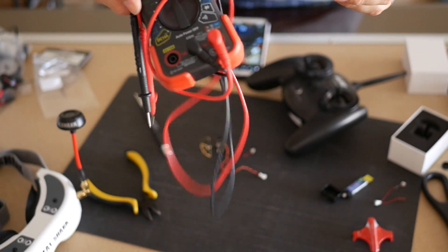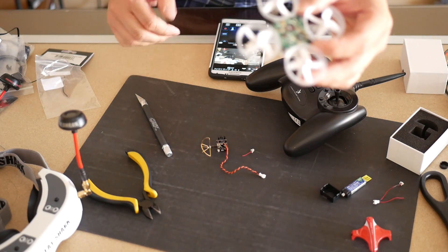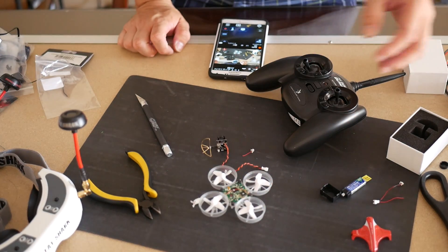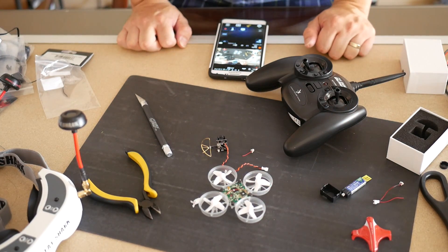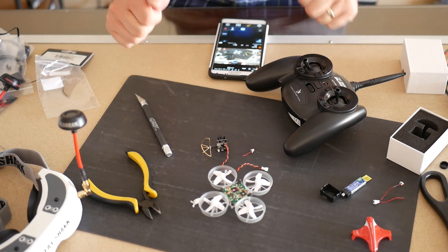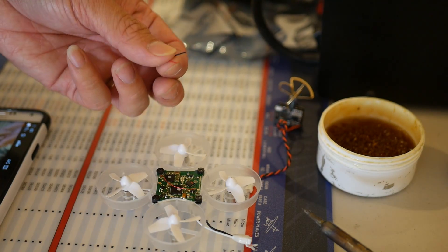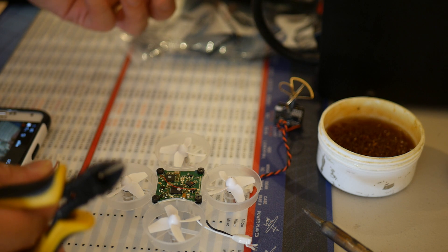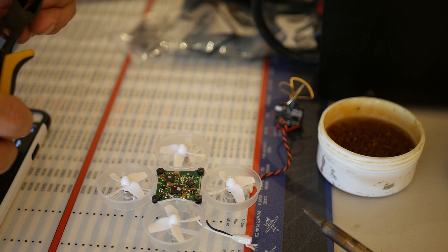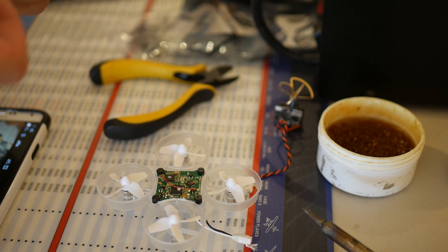It's good to have a cheap battery meter — get a 10 to 20 dollar voltmeter from Radio Shack or Home Depot so you can properly check the polarity before soldering. Now let's go to the soldering bench. First strip your little connector wires. It's good to have sharp diagonal cutters or wire strippers. I like to use flux — some guys skip it since their solder already has flux built in.